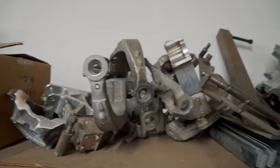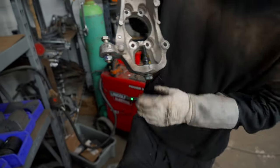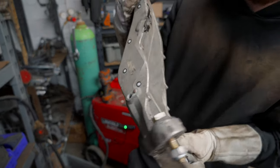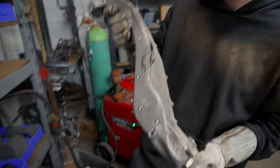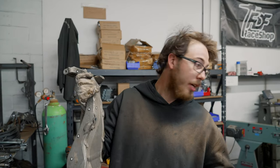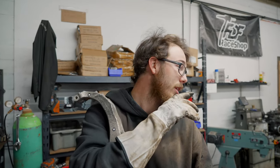This is a 370 knuckle, so we make our 370 mini kit from this. We can bolt our plates on and basically just replicate it as close as possible to how it's going to be in the car, just to make sure everything lines up properly — your tie rod pickup works and all that good stuff. This is on the easier side; you just bolt it up, tack it up, and weld it. Once you get one in the right spot, you can make a solid jig using a couple reference points and it's very easy to replicate over and over.